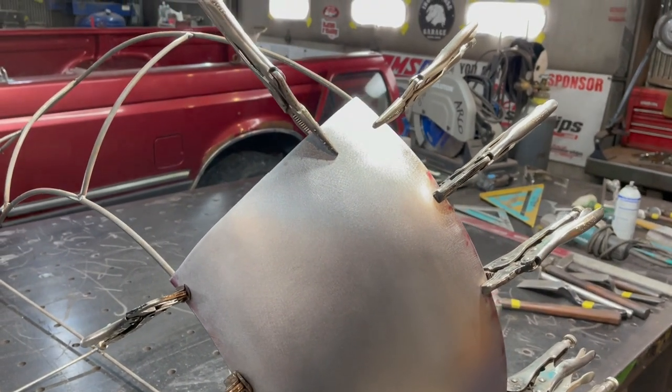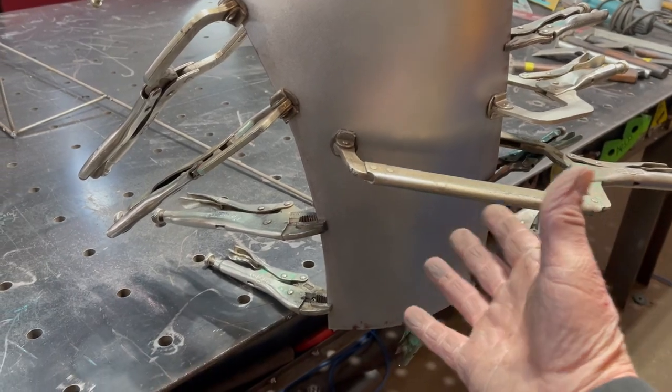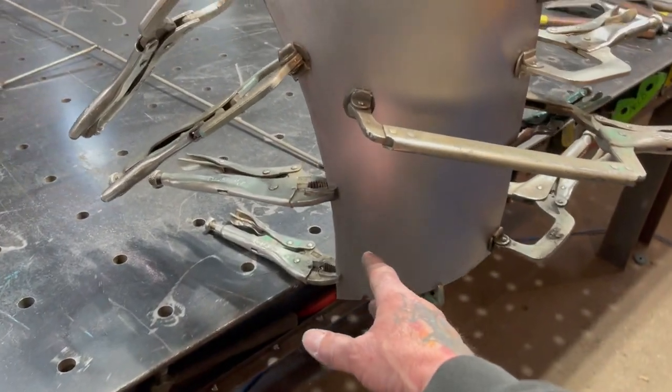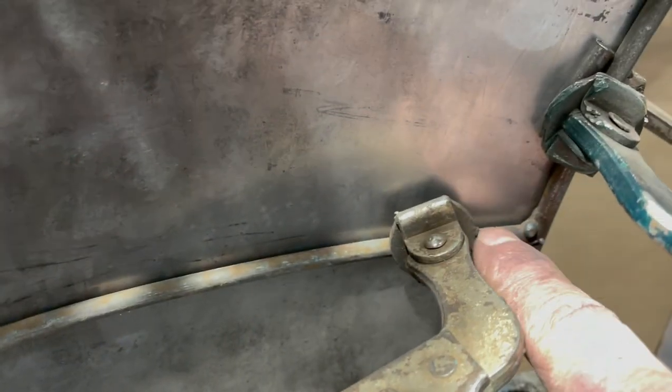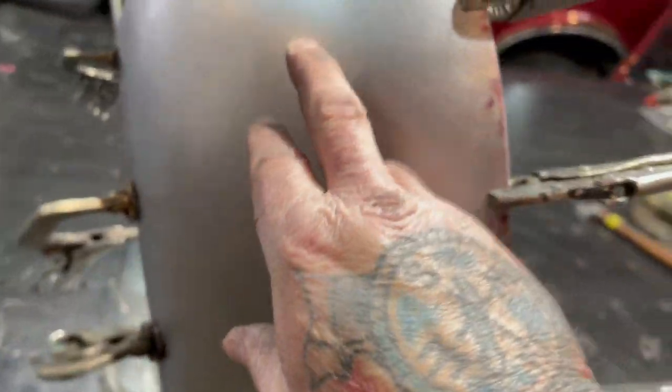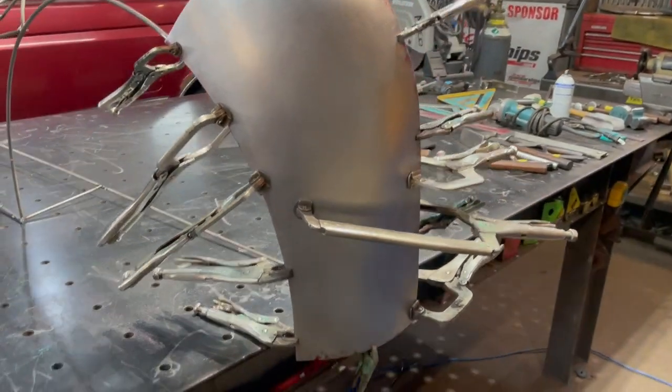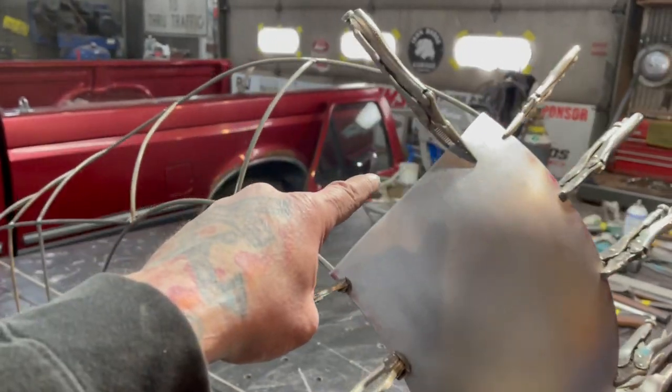If you're a fabricator or a metal shaper, you're going to need lots of vice grips — C-clamps, welding clamps, whatever you want to call them. I clamped it on here real quick just to make sure there's no gaps. If you go to the back on the buck, you can see there's no gaps right here, and it goes all the way across nice and smooth. That tells me it's the shape that I want. Now this sheet metal panel mimics that metal buck that we built.